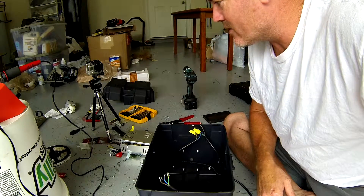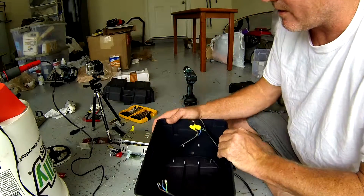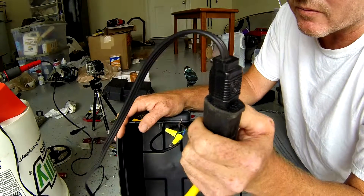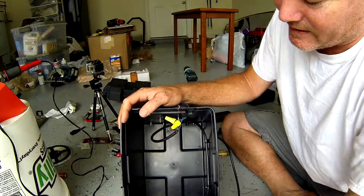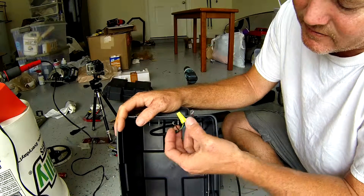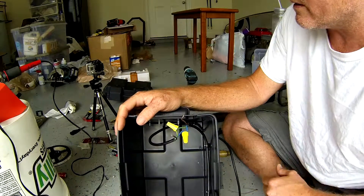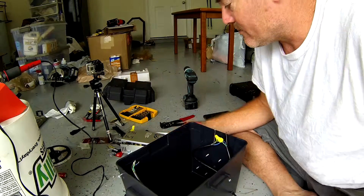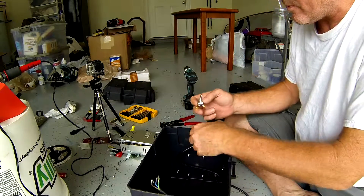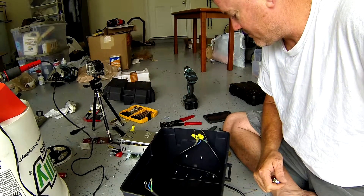I made a super bad error. I was trusting the multimeter to tell me which color was what, and not actually testing the wires coming out of the power supply. What I did is I thought the green wire was the hot — but green isn't the hot. It's the brown wire that's hot, and blue is the neutral. So now I can hook it up correctly, and I'm hoping that the 360 watt power driver isn't messed up. So I'm going to re-hook this up, fix it, put my switches back in, put everything back on, and see what happens.